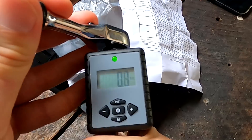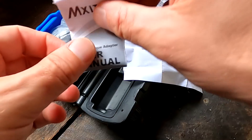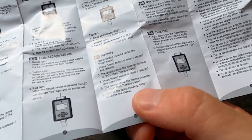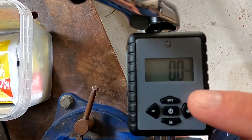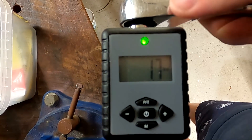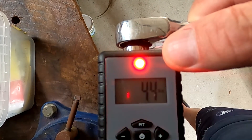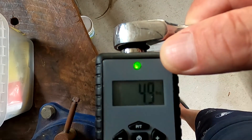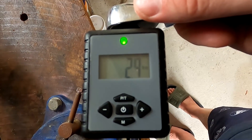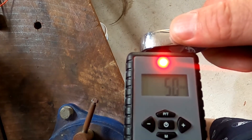The trace mode gives you a live view of how much torque you're applying, and the P50 mode saves the last 50 readings. I've set the maximum torque to five newton meters. When you start cranking the ratchet, you get a green light and the torque increases. Once it hits around 80% it turns yellow and flashes, and once you hit five newton meters it beeps — there we go. It warns you before you reach the set torque so you don't overshoot.